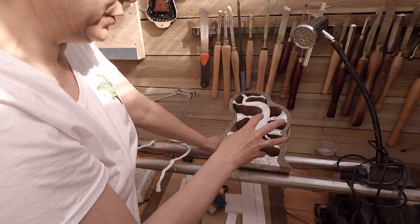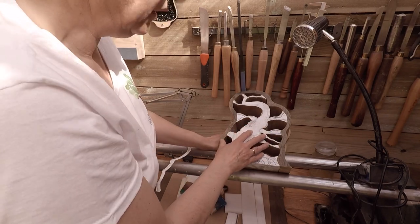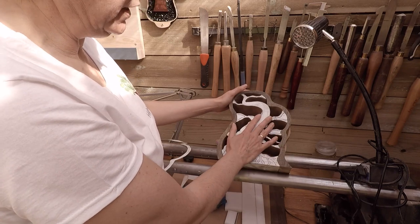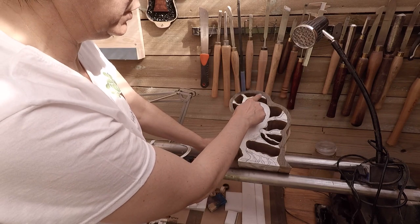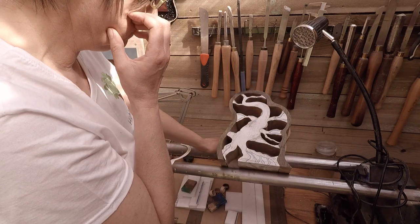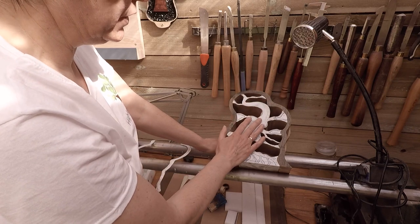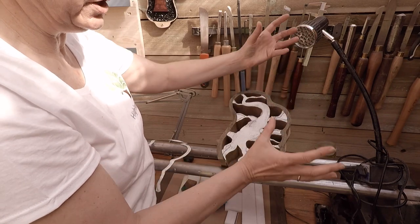that to prepare the wood for the top of this, because this box is a bit like 3D. This part stays at this level and will be glued down and sanded. That part will then be complete. This part here, I then place this out onto some nice figured wood, really, that I can get some of the running features of the wood for this 3D bit, and then I shape it. But I always cut it out. If you've ever heard of intarsia, when you're placing intarsia on, you sand the edges over, but they're joining to make a whole picture.